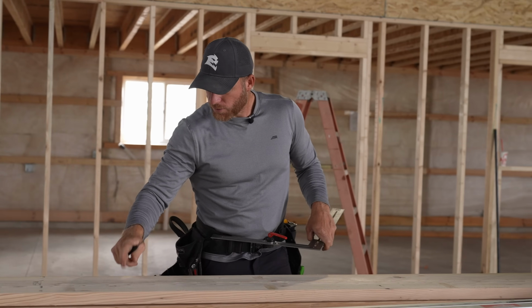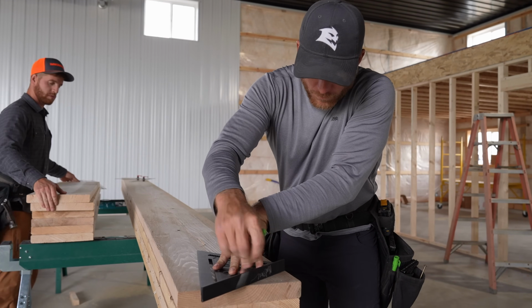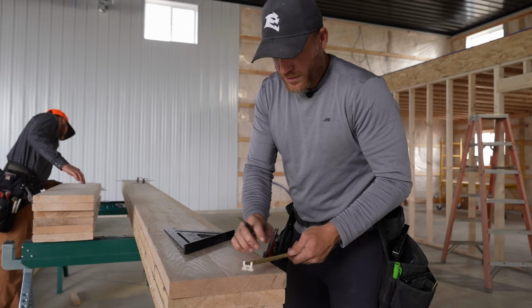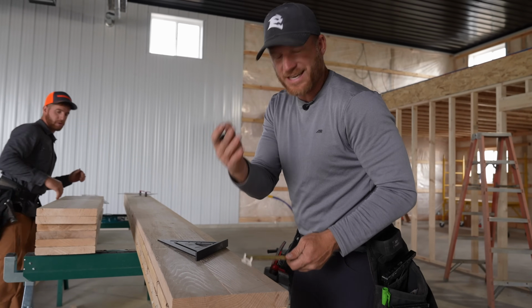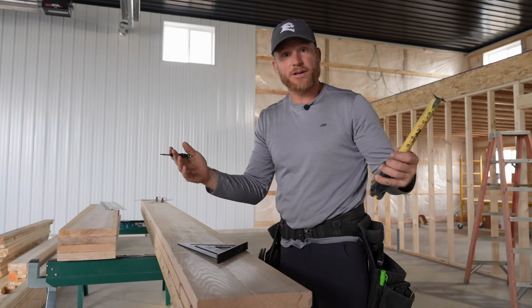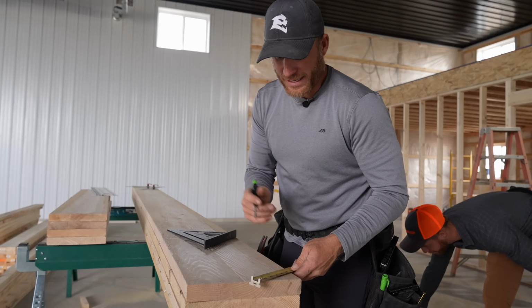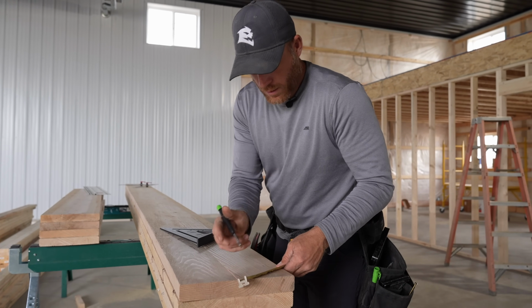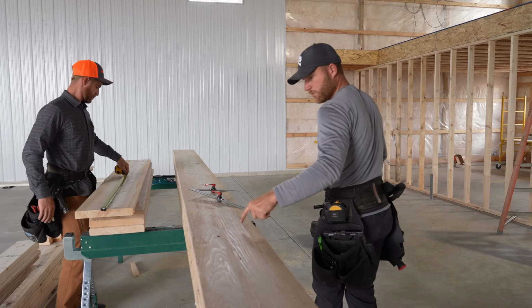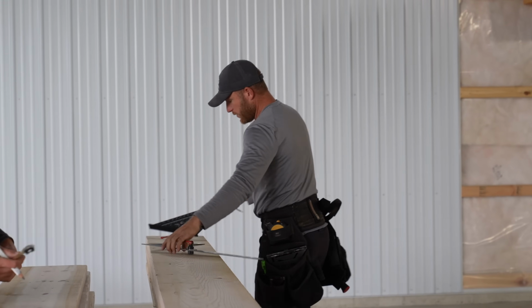Let's see, 1, 2, 3, 4, 5, 6, 7, 8, 9. As long as this is, okay, good. Because this is our bottom of our step, and one of the things you always have to remember is you gotta reduce the dimension of the tread on your first step, because stepping off the ground, you only wanna go 7 1/4, so I don't just make this a 7 1/4 rise like all these other ones. I need to do 7 1/4 minus 1.5 inches. So this is actually gonna go here. 1, 2, 3, 4, 5, 6, 7, 8, 9, 10, 11, 12, 13, 14,